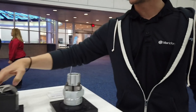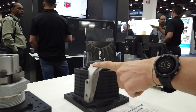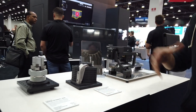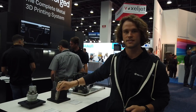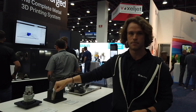Here's another new demo that's really exciting — this was featured on a BattleBot recently. This is a generatively designed metal part. Basically you put in the parameters of the types of loads that are going to be put on the part, where the loads are going to be placed, and what critical dimensions there are. Generative design gives you a bunch of different design ideas optimized for the strength and weight you're looking for. Using the Metal X, it's very easy to load that STL onto your printer to get this really cool shaped metal bracket optimized for strength and weight.